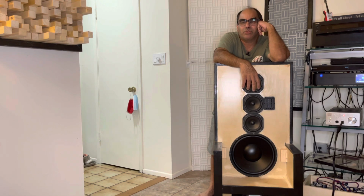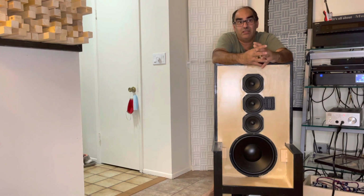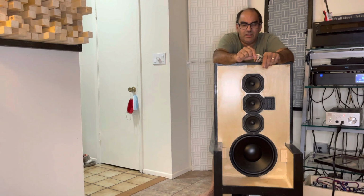Went to bed, got up the next morning, and then I realized those stupid wire coils that they put around those caps, they actually go to this junction block, and there's some funky electronics that David Hafler did 50 years ago in that, man. Stuff that I'm not too impressed with, I'll be honest with you. The thing sounded good, and I'll get to that in a minute. So Sunday morning I got up, took a short piece of wire, soldered it from the negative terminal to this funky block underneath, and voila, I got sound again. Doesn't make any fucking sense, but whatever. It's clean, it's good, and the noise was gone.